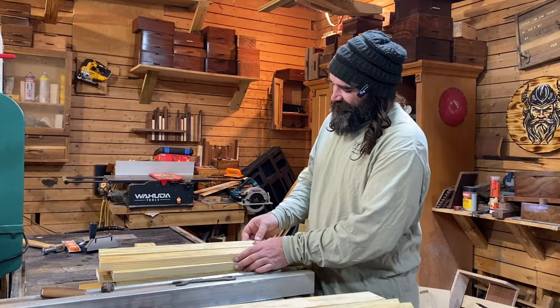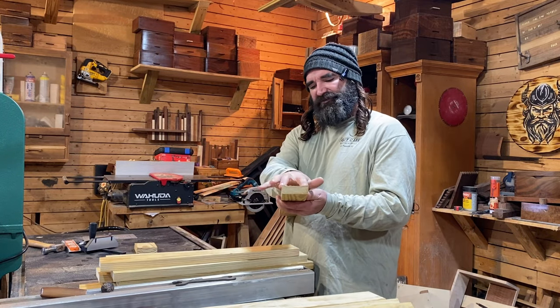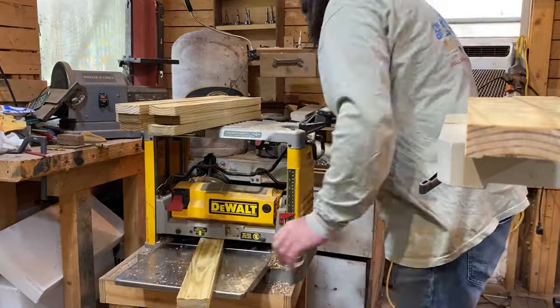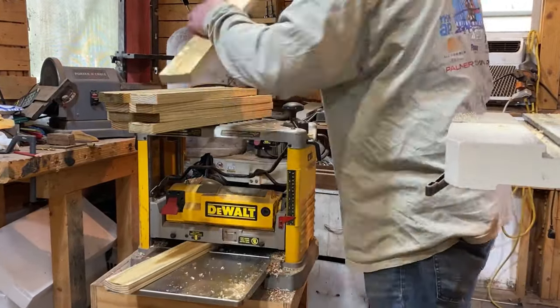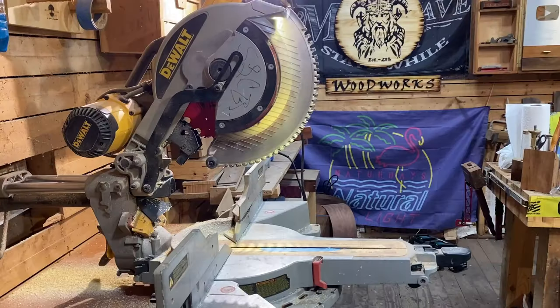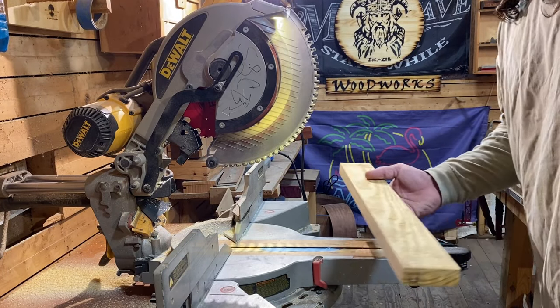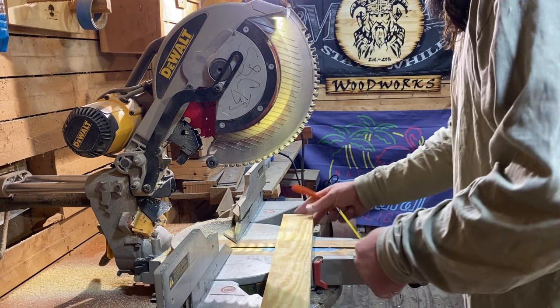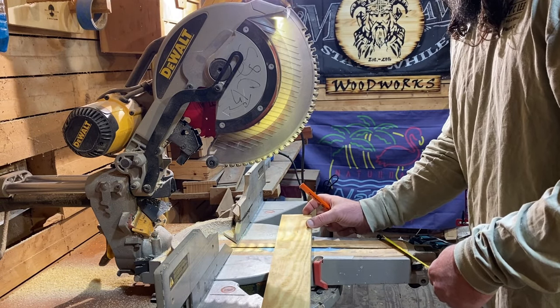All right, now let's head over to the planer and rip these humps off of this piece. Using scraps, or in this case, any leftover material, is super important when you're building a prototype. Over here at the miter box, we're going to take and cut 4 little squares. And these will be for the bottom of our 4 feet.